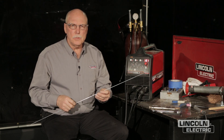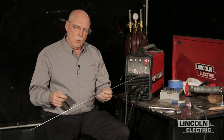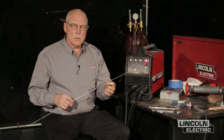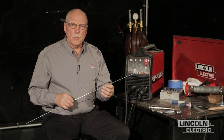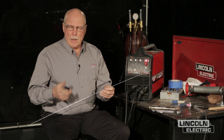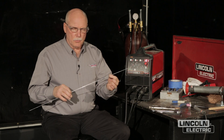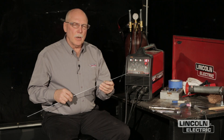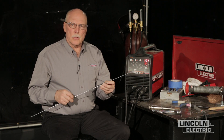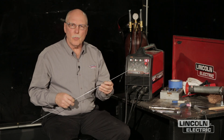That cracking is our nemesis when we start welding on tools. The material's so hard and so crack-prone that when we weld it, our weld cracks next to the weld in the base metal. So with 312 stainless, which has 30% chrome and 9% nickel in it, we get some great mechanical properties. Adding 30% chrome and 9% nickel to make it 312 stainless, we come up with a metallurgy called an austenite-ferrite metallurgy, and it's really crack-resistant — as crack-resistant as we're going to get with anything readily available in industry.